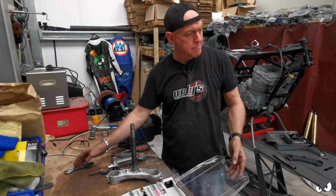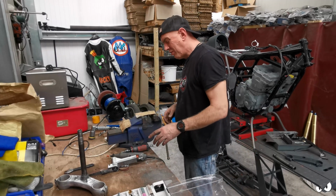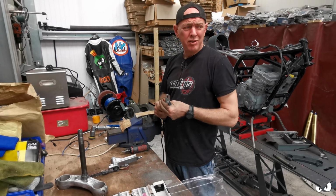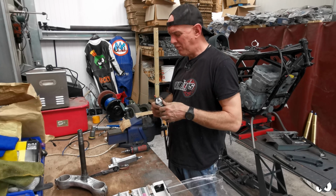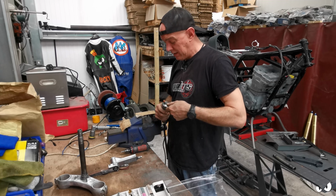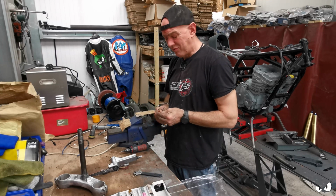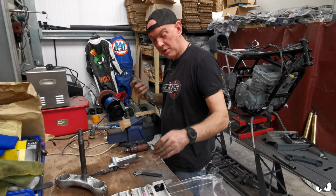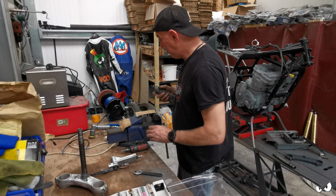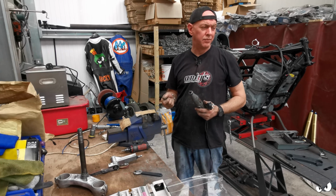When I was TIGging it, the castings were horrible. You never really know what you're going to get in a casting, ever. It's made up of like, I don't know, crossed up baked bean tins and mangled foot pegs from crashed bikes, and also it's just mystery metal number 7 basically. So when you're TIGging it, you get all this junk and rubbish and just nastiness floating up in the puddle. And it's no good because it all goes porous basically, so you have to get rid of it. So I was running the TIG with more cleaning than I ordinarily do.